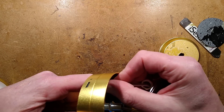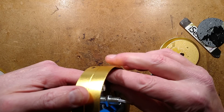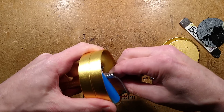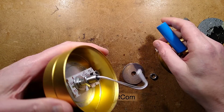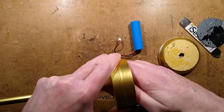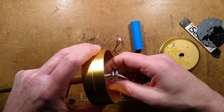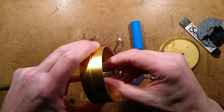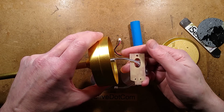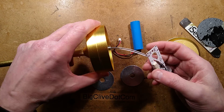Let's unplug this — that's the LED's other end unplugged. I'll unplug the cell as well, because I notice the circuit board is just wedged against the metal surface. This looks like just the power circuit board but thankfully it's just single-sided, that's good — I was wondering if it was double-sided because there'd be a risk it could short against the metal.